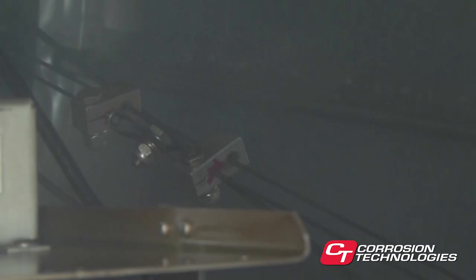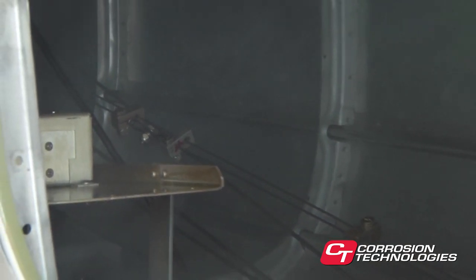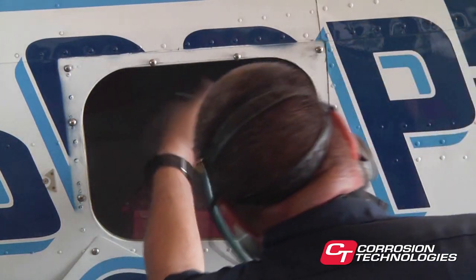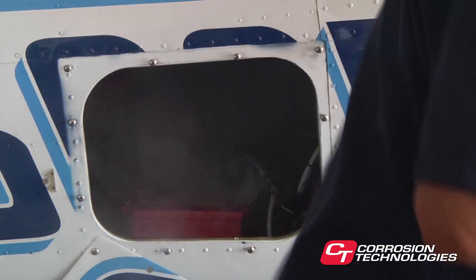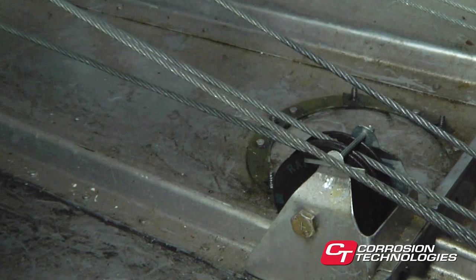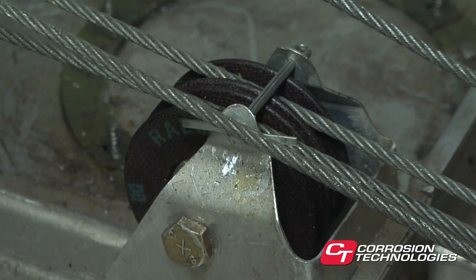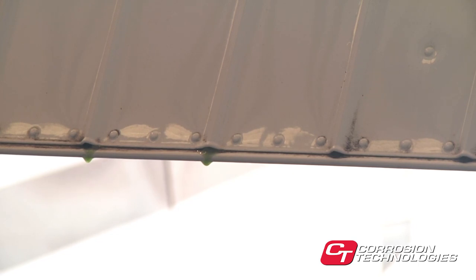To show how thoroughly and effectively the Handy Spray system treats an airframe, look at this aircraft tail section that was sprayed a full five minutes before this video was taken, so you can get an idea of what's going on inside enclosed areas while you're spraying. When the trigger is pulled, CorrosionX is atomized into micro droplets that fill the enclosed area with a smoke-like fog. The product stays suspended in the air for an extended period, allowing it to migrate as its unique polar bonding chemistry attracts the suspended CorrosionX to metal surfaces, almost like a magnet. CorrosionX creeps and seeps into joints, around rivets, screws, and bolts, until all metal surfaces are coated in an ultra-thin film. After a proper application, CorrosionX is often seen seeping out between skin laps, ensuring that it is reaching the most vulnerable areas where corrosion usually starts, around rivets.